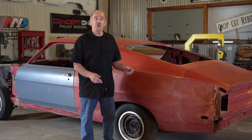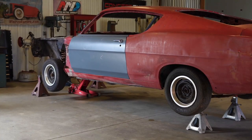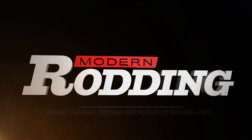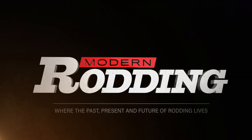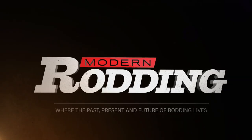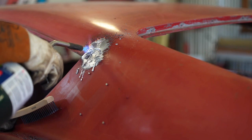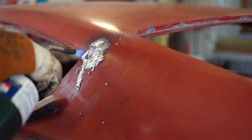Follow along — we're going to show you how to get this car up on jack stands, support it correctly, and get the panels off and back on. If you're doing the job and you're going to take the quarter panels off the car, make sure that it's supported underneath the suspension. It helps to carry the load and keep the car level. I recommend you do one quarter panel at a time if you haven't done this before.